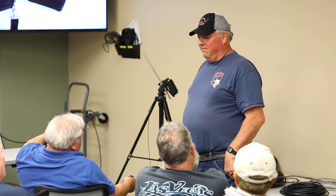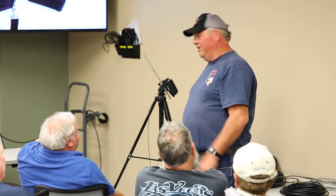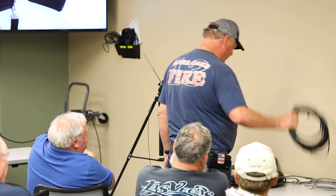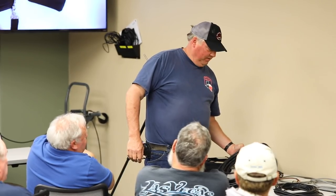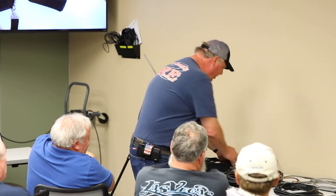Now, what do you think the difference is between them? They're both 50 feet, they're within 1 inch of each other. They're wider band? Better wire, bigger wire, wider bandwidth. Diameter. What else? Velocity. Well, I happen to know this is 0.8. This is 0.73. Why it's 0.73, I don't know, but it is. And it just worked out that way.